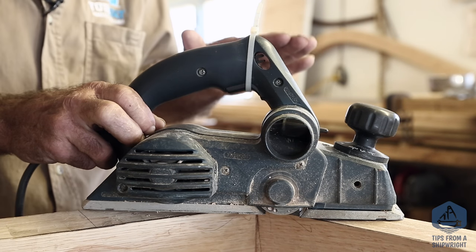This is a very delicate operation and I've got a very aggressive tool, so I've got to start with it adjusted where it doesn't even cut and then work my way up so I know exactly how much I'm going to take off. I'll start taking off quite a bit of material and then reduce the amount of cut as I get closer to the line. This is a project I used to accomplish with a number 5 Stanley plane — it's much harder to get yourself in trouble using a hand tool than with this electric plane, but after a little bit of experience I still think the electric plane is the right tool. And you can see I've flushed down that corner really nice and flush and have not removed those two pencil lines.